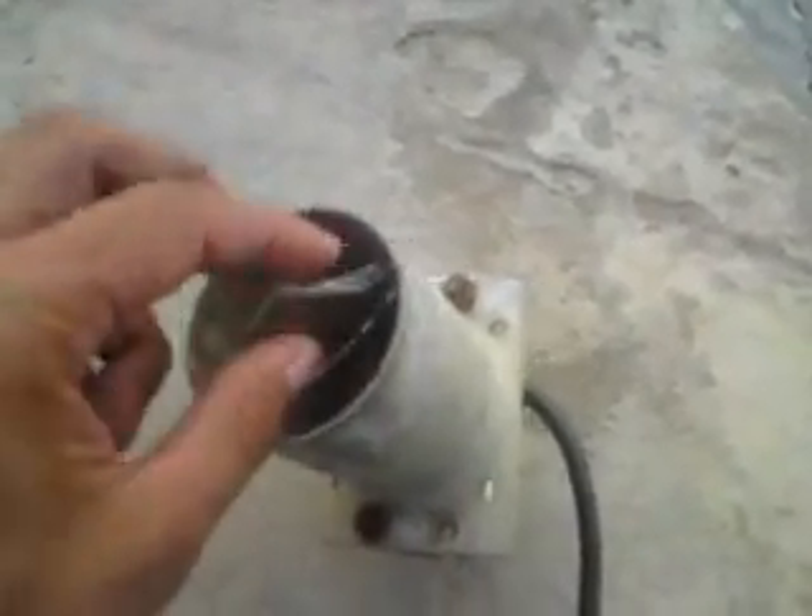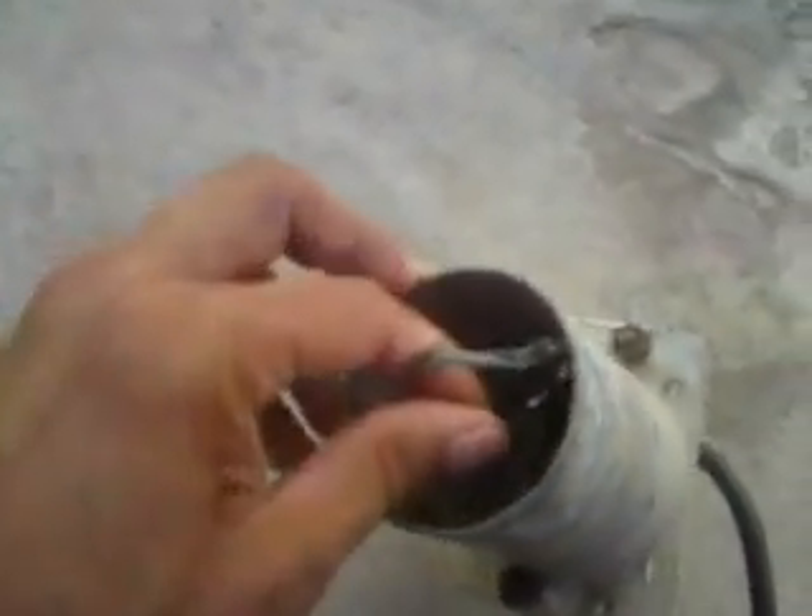This is your LNB and this is the glass piece I have put inside it. Now I will bring it out. This is the piece of glass I have used instead of Teflon — I broke a bottle and got it. See its width and its shape; it is not regular but it is giving me a good signal.